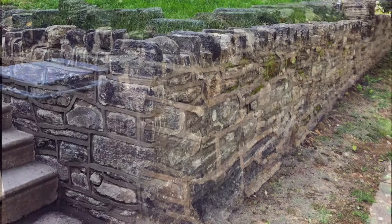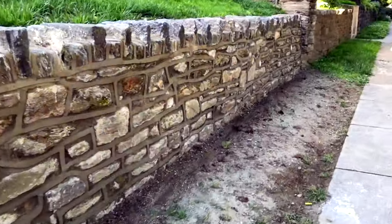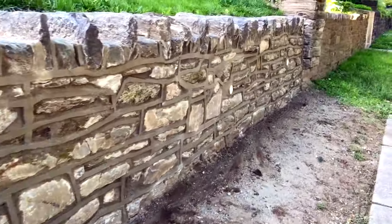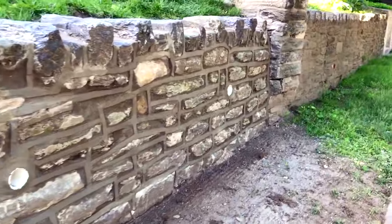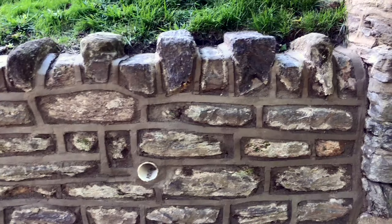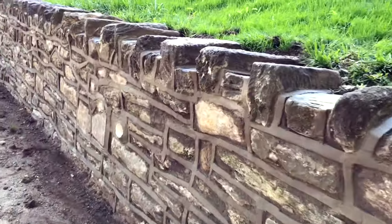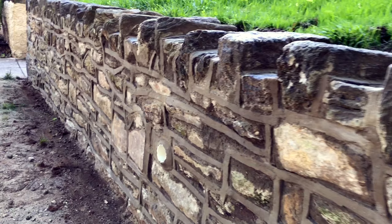This wall has now been restored to reveal the beauty of having a stone wall. We removed the bulge, plumbed and leveled the wall, we matched the style of the original pointing and installed a pressure relief system to protect the wall from hydraulic force. Mr. Sabo now has drains that are centered to maximize their effectiveness. If water is present behind the wall, I can't stress how important it is to have these drains. When a wall is out of plumb, it's usually because the drains are not present.